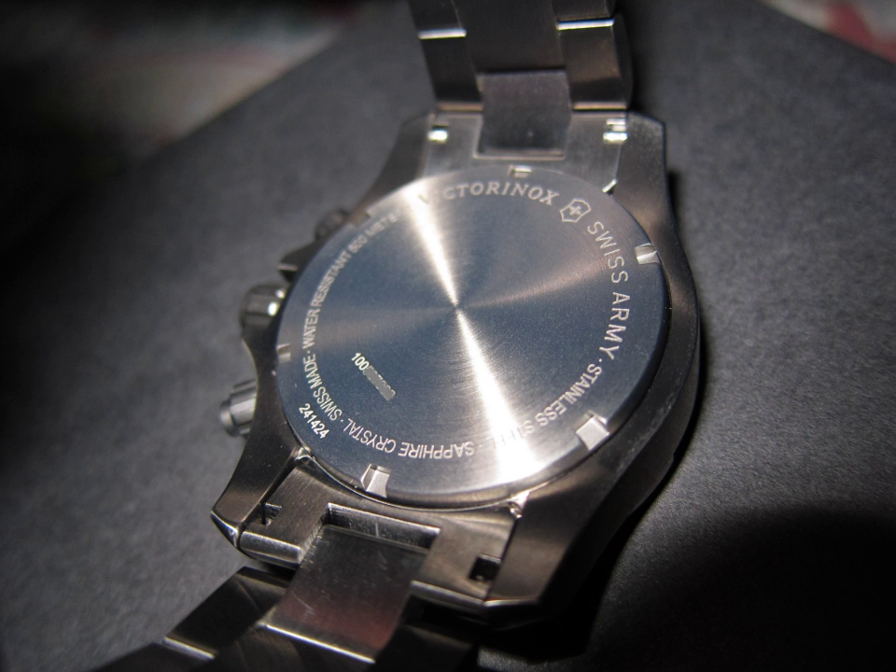The composition of the gas mixture used for the test shall be given in the operating instructions accompanying the watch. Most manufacturers recommend divers to have their diving watch pressure tested by an authorized service and repair facility annually or every two to three years and have the seals replaced. Watches are often classified by their degree of water resistance which, due to the absence of official classification standards, roughly translates to general categories. These classifications have since been superseded by ISO 22810-2010, in which any watch on the market sold as water-resistant must satisfy ISO 22810 regardless of the brand.